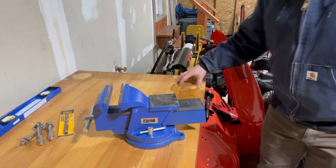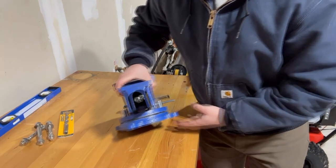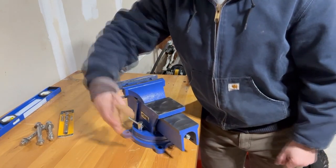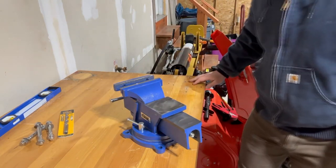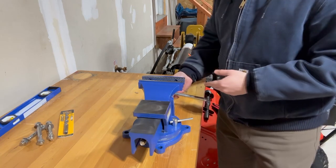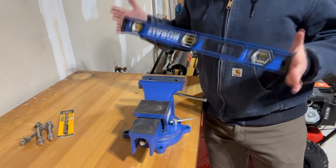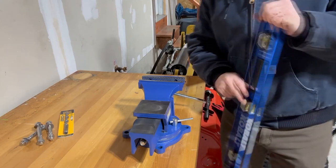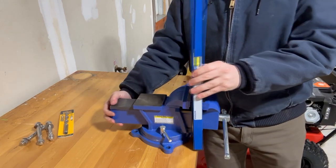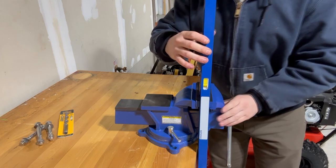The plan here is to mount this on the corner of my workbench. There are — if I spin this around, you should be able to see it here — three mounting holes: one on this side, one on the front, and one in the back underneath. So I would like this to be on the end of my bench in a position where I can use it on the front side, and if I turn it to the side I can work off the other end. I'll use a level just to make sure I have my jaws lined up with the bench, because you don't want to be working on something that's too long and have it collide with the bench. I'd like it to extend out here where I can put something in the jaws and not have to worry about it colliding with the bench.